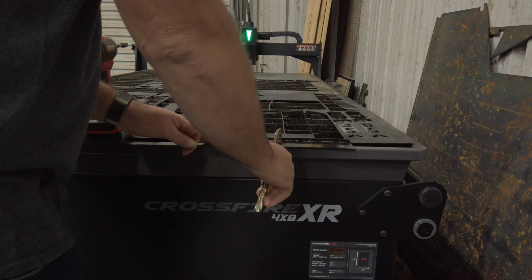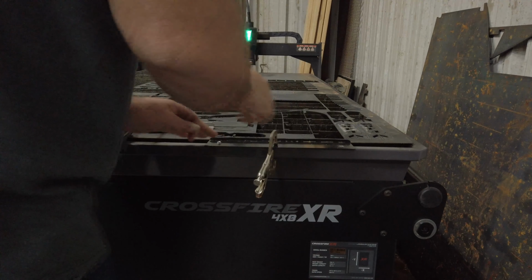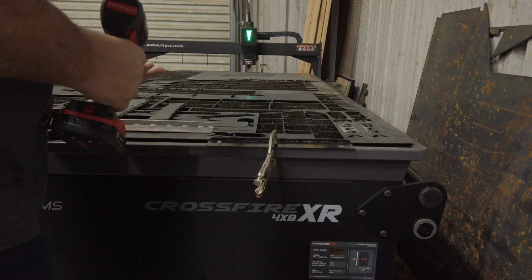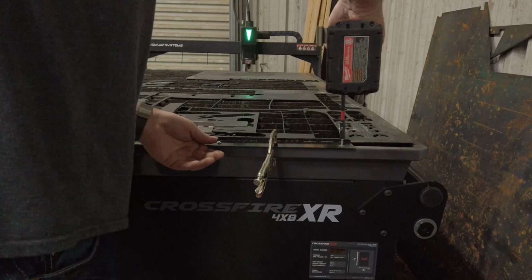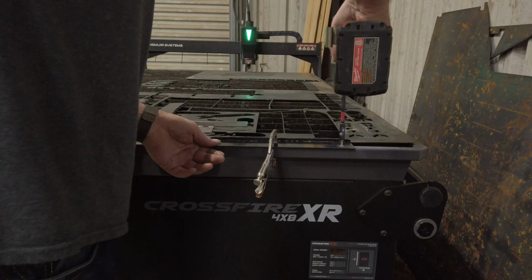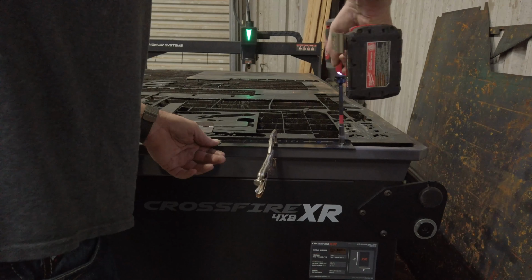I'm going to put the files on FireShare in case anyone else wants to do it like this. I installed these brackets with 1/4-inch self-tapping screws by screwing them directly into the water pan. Just make sure that you're not too close to the edge of the square tubing when you install the sheet metal screws, or you could create a leak in your water pan.